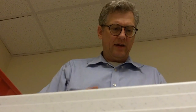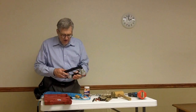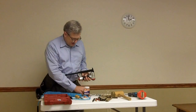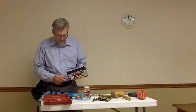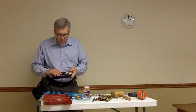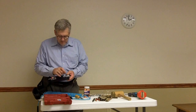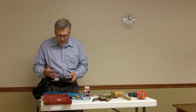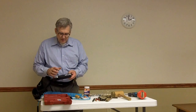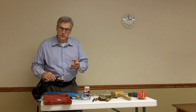It is disconnected from the air, so I can open it now safely. Don't have the air connected when you open it up to add staples — always have it disconnected when you do that. There is no special safety mechanism on the trigger on guns this size because the staple is so small and the gauge of the wire is so fine and lightweight. It can cause damage, but it's not life-threatening typically. I've never seen a serious injury in an upholstery shop.